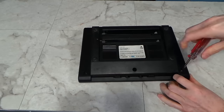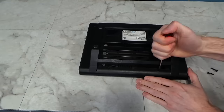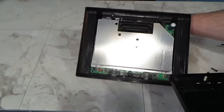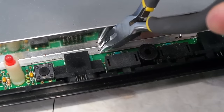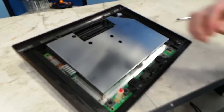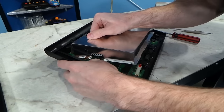Now it's time to open up the 7800 and take a look inside. There are 5 screws on the bottom, which I'll take out first, and it opens right up. This shield has to be removed — there are little twist tabs that will need to be straightened out with needle nose pliers, then it should lift off. However, mine was extremely stubborn, almost like it was glued down. I realized I could still pull the board out even with the shield on, and I eventually managed to work it loose.